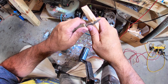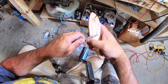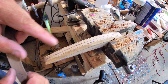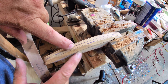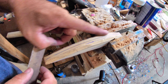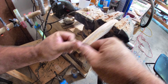Here we go — got to figure out how to do this around the camera. We're going to carve in between this line and that line right there. You might get some tear-out; if you do you can always go the opposite way. I'm not too concerned about tear-out because I'm going to get all that sanded off anyway, so it doesn't really matter.